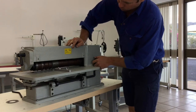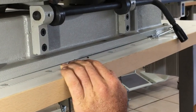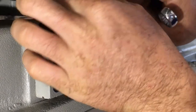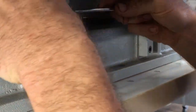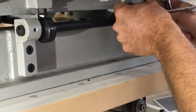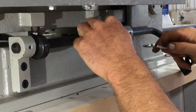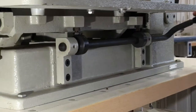These are a bit of a touchy-feely thing. You don't have to have them ridiculously tight at all — just enough to cut the leather, not enough to blunt your blade. So to adjust your tension on your roller against your blades, you have these locking screws here. Just loosen off the top one and then set it — this one seems to be about three turns up. And once you get it there, you can use a spanner to tighten that down. Same for the other side — tighten that down. And then this should just adjust up like that.